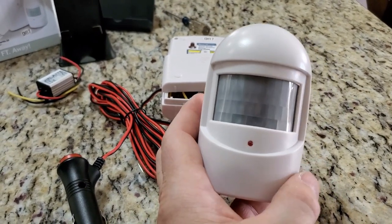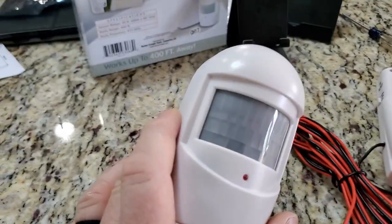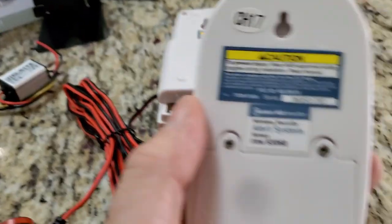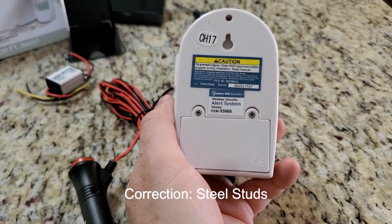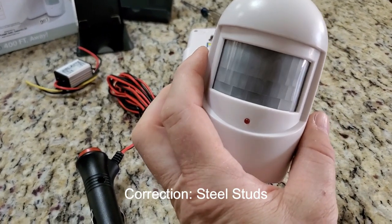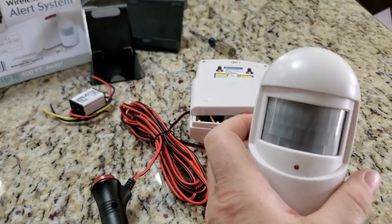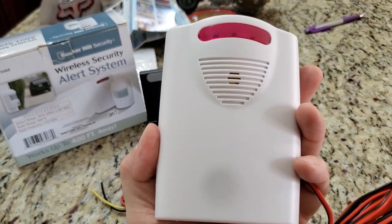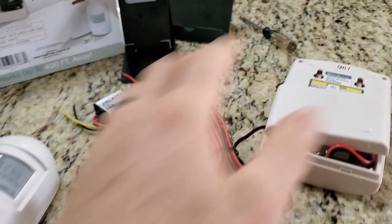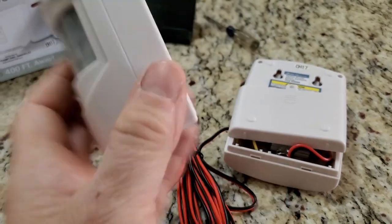When you're not using it, it's not transmitting, so just put it in a box or disconnect the battery and take it with you when you go camping. I'm going to glue a magnet on the back of it — my trailer has steel joists so I'll be able to stick it anywhere on the camper, front or back. I'll probably pick up one or two more sensors. It's just a way to take a cheap wireless motion sensor driveway alert system and make it run off a 12 volt outlet in your cargo trailer. The magnetic mount will be handy because I can stick it anywhere.